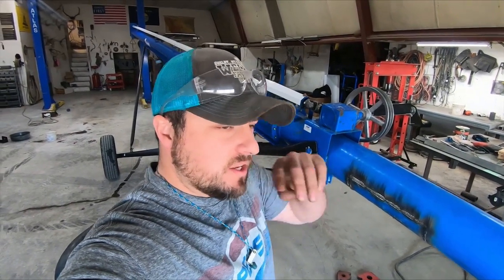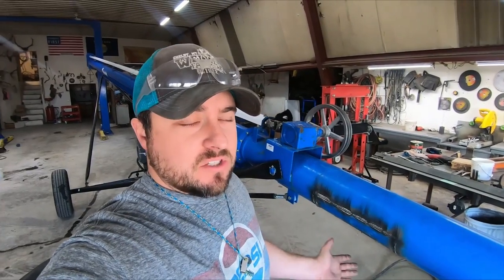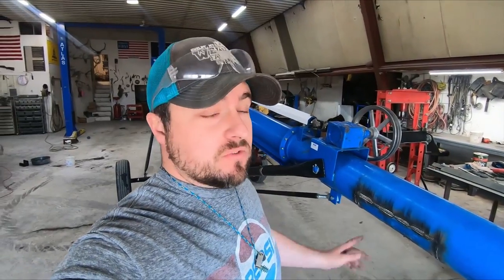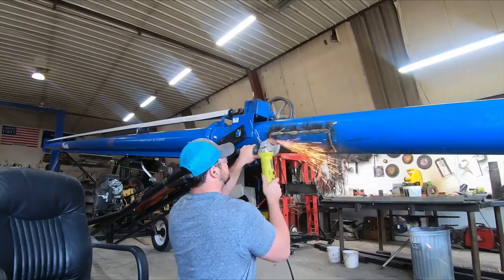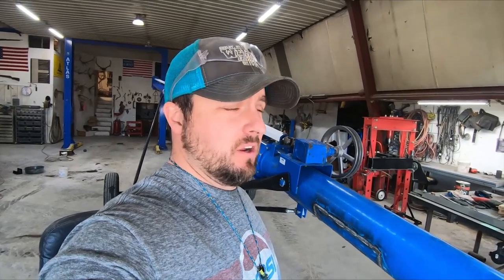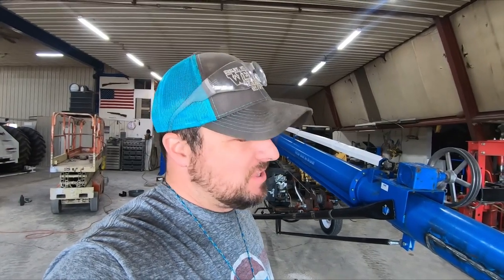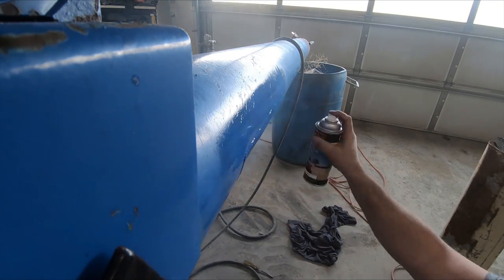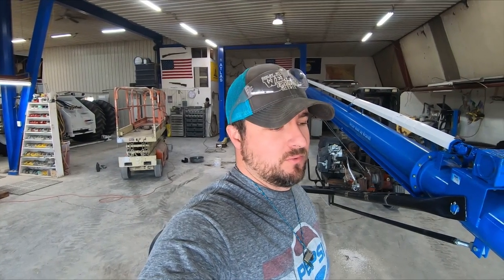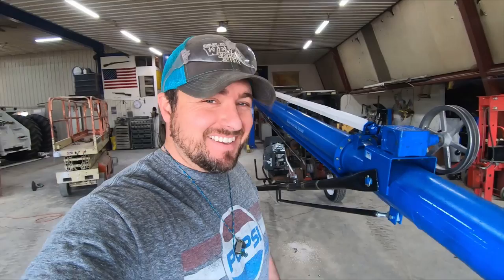Because the metal is really thin, it was hard to weld on — just old age and wear on the bottom. The welding is really patchy, but I'll lightly take the grinder and knock off all the high spots. I won't get it perfectly smooth because I need the material there to keep it together. It's going to be ugly for the rest of its life. Let's throw some paint on it — how about Ford blue? That looks close enough. It's definitely going to clash, but that's okay. Guess who just got done painting something and decided to lean into it?